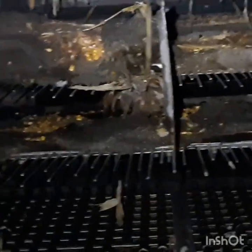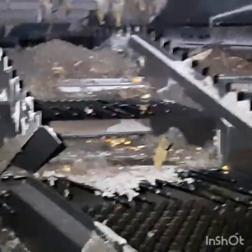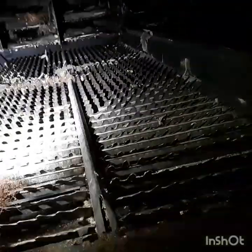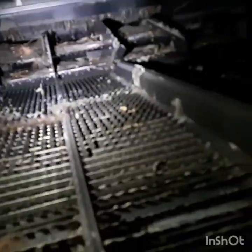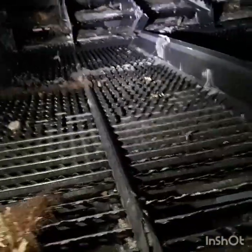When I say iced up — on top of those tines that's a four-inch wall of ice and snow that isn't supposed to be there, and that's from sitting overnight. So I'll get the burner in here and the space heater to help get some heat going inside this thing. You can feel the coldness inside back here — it's still just a block of ice. There's ice down below the chaffer too. The chaffer itself is fairly clean, but below the sieve the sheet metal has ice built up on it, so the corn can't flow down into the augers like it's supposed to.